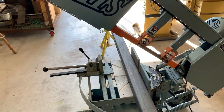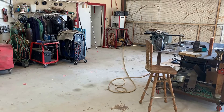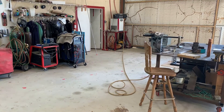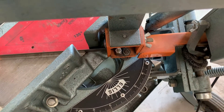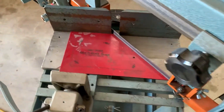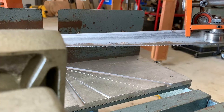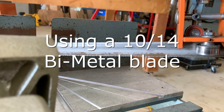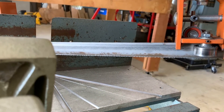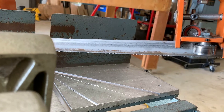That's pretty close. I use an Ellis 1600 bandsaw, but in a pinch I have used my DeWalt chop saw — it doesn't make quite as nice of a cut and it's harder to get the angle just perfect. When I set my saw, I like to use the included angle finder, but I also put an angle finder onto the blade to make sure I've got exactly 45 degrees. The blade I'm using is a 10-14, so it has teeth set at 10 teeth per inch and also 14 teeth per inch. When I'm cutting lighter stock like 11 gauge, I like to make sure I've got a real smooth cut — that's why I use this blade. It's a bi-metal blade.